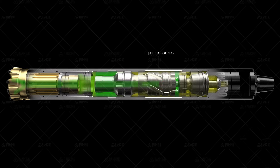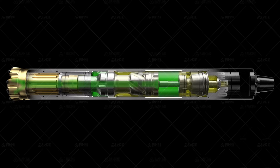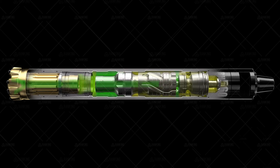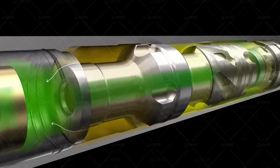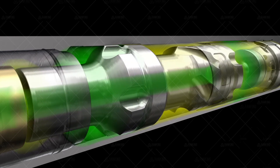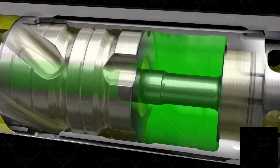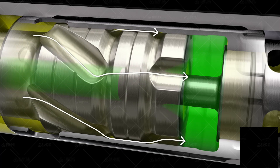With DTH drilling, the same drilling team can work through multiple materials. At its most basic level, DTH drilling involves attaching a drilling hammer to the bottom of a drill string. Small percussive hammers are placed above the drill bit, allowing drill pipes to exert a feed force necessary to rotate the hammer and bit together with fluid — usually air, water, or mud. This actuates the hammer and flushes the cuttings. Drill pipes are then added to the drill string as the hole gets deeper.